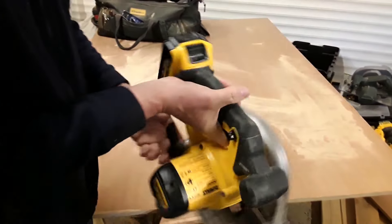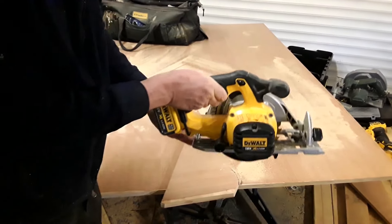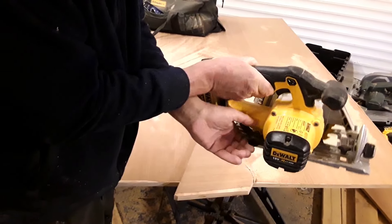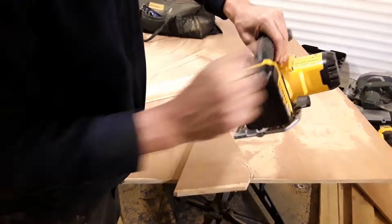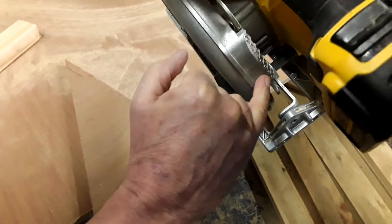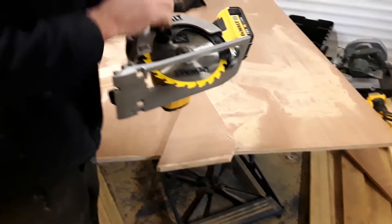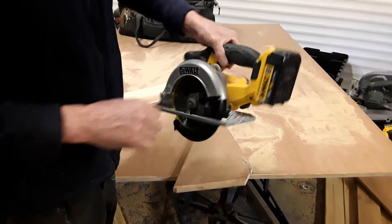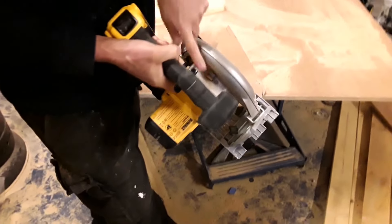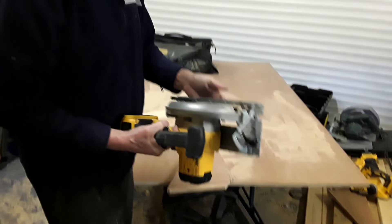For the adjustments, it's very, very simple — in fact, nearly all circular saws are this way. It's just a quick release and the bed goes up and down like that, just as simple as that. We've got a measurement down this side, though personally I always check depth with a tape measure. And that there locks the motor if you want to take the blade off, which you might do for sharpening or different styles of cutting.